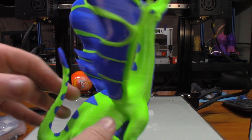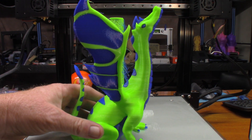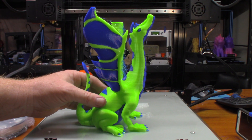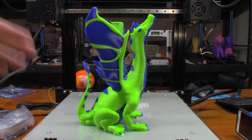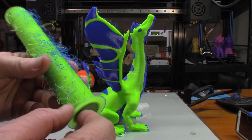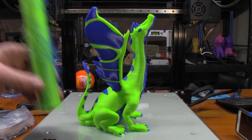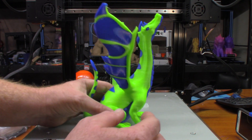I don't like using brims, but I went ahead and used one on this. At the time when I started the profile I did it in Cura 3.6, and that version didn't have the option to put a brim just on the prime tower. The prime tower definitely needs a brim, otherwise it will fall over — especially when it's going up that tall. That's a pretty tall prime tower.